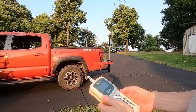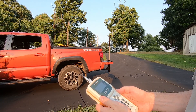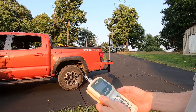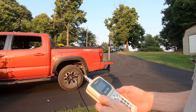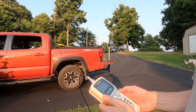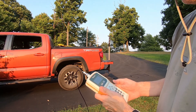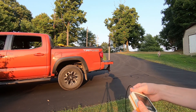28.340, which is my club's 10 meter net frequency. It's right around 1.5 — the wire's a little short for that, but that's okay. I'd rather be more resonant on 40 meters because that's where I do most of my contacts, so I'm happy with that tune.